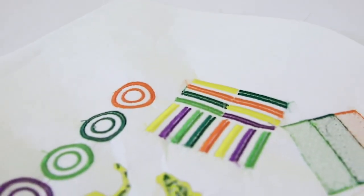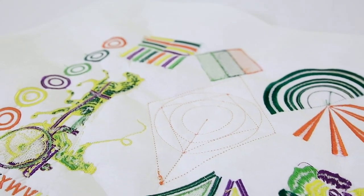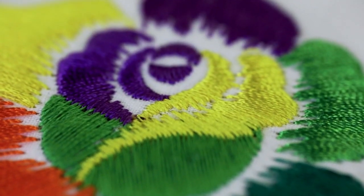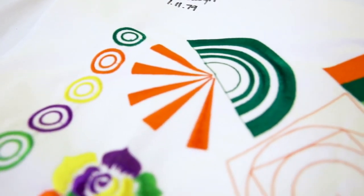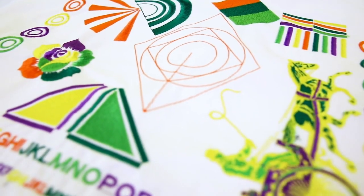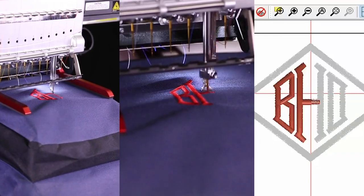With the EMT16X and the improvements in the firmware, as you can see now, the bobbin distribution, meaning the thread tension during embroidery, is highly controlled. One of the test designs that we run a lot here at Melco is a very demanding design for an embroidery machine. It has all kinds of different design features in here that test for cleanliness of small lettering, thread break performance on small lettering, column distribution and cleanliness in different directions. So if you flip over the embroidery from the back side to the front side, you can see that the result of the improvements in the firmware for the machine result in a very clean, high-quality embroidery for our customers. There's no other company in the US who can say that their equipment is designed in the US.